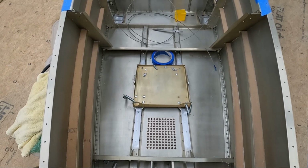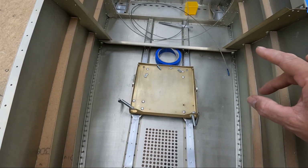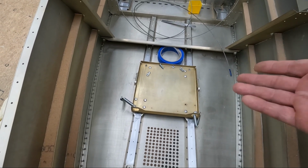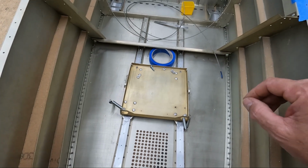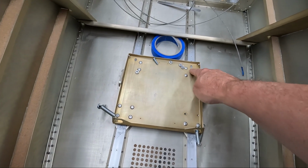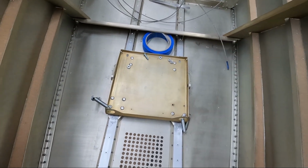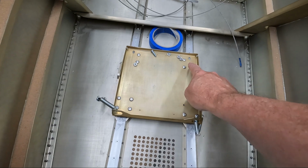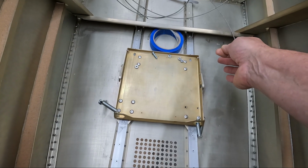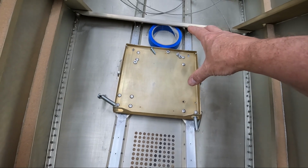One of the things I've been trying to figure out is the rudder pedal tray adjustment, or at least the feature that's designed to adjust the rudder pedal tray in the manual. The manual has some wires that come across here with a pin or a lever that goes down into this hole that's supposed to catch into holes drilled into the track. And this piece of metal comes up here and bends up here, and you're supposed to be able to, with your heel, push down on it to disengage the rudder pedal tray and move it back and forth.